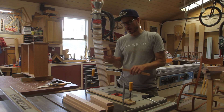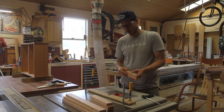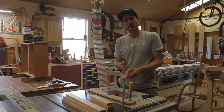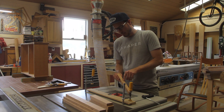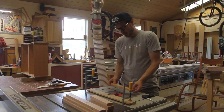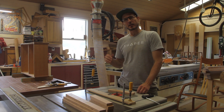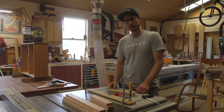In this application I do want that panel — which isn't a true half inch — flush to the outside face. If I didn't care, I could set it center and the panel would be set back a little, which is fine too. But I'm going to do it this way: I have the back mark, which is the important one because that's where the back of the panel goes straight in and the face gets rabbeted. I'll lay that down, set it up, run face down on all the parts, get that cut, then lower the bit until I get about a quarter-inch width to match the tenon.